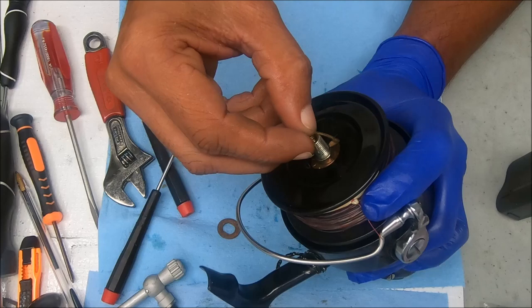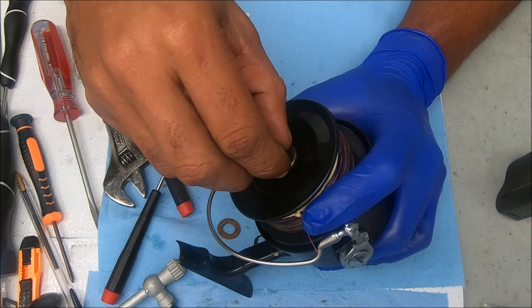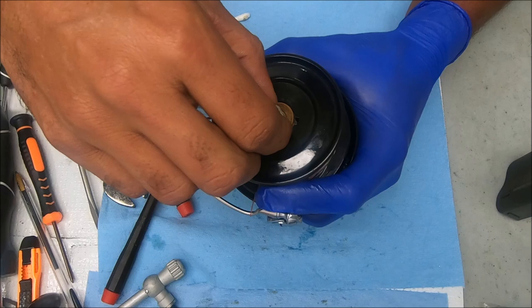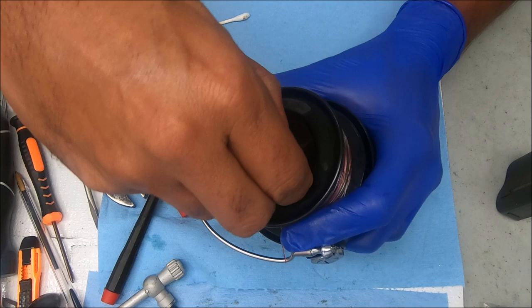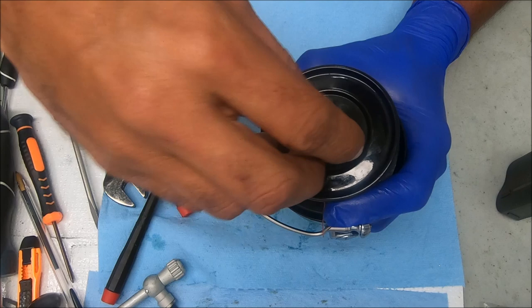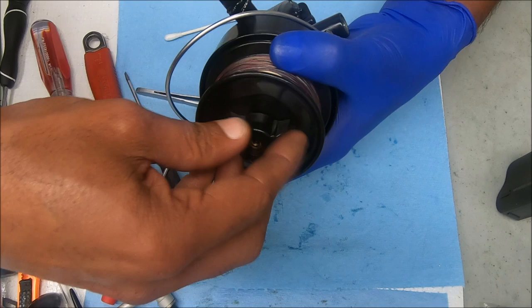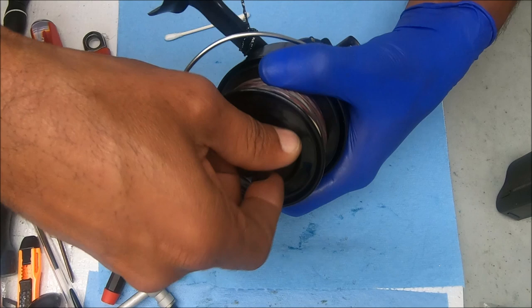Then you have the spacer here. It's kind of like the spring action for it. The last washer is a keyed washer. And when you get to this last washer, you want to make sure that that is sitting over the groove on the shaft. We're going to tighten this down and see to make sure we have it right. It's looking good so far.